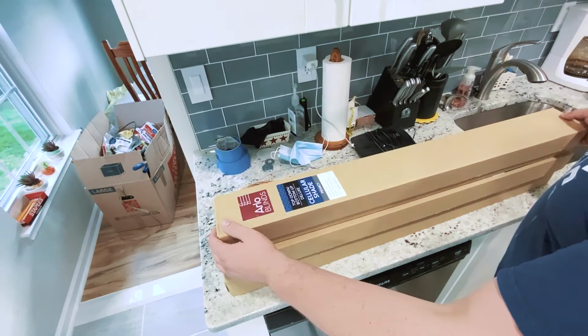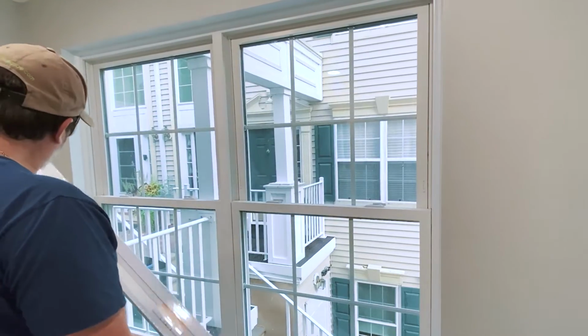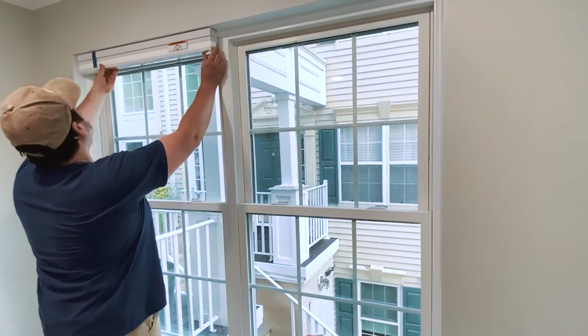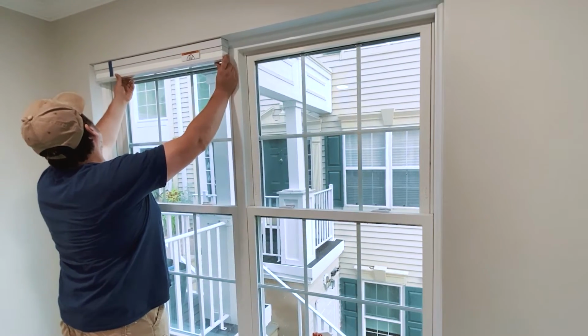of your blinds. After selecting your preferred style of blinds, open the packaging and physically measure the blinds against the opening of your window to ensure they fit as planned before proceeding. You do not want to go through the hardware installation process only to discover the blinds you purchased do not fit the window opening as expected.